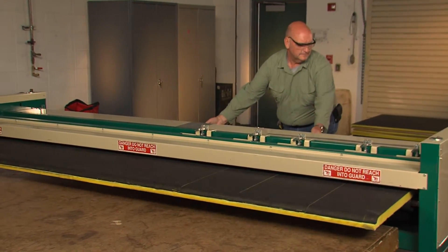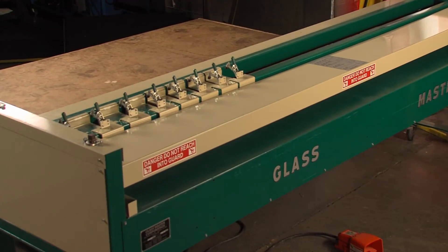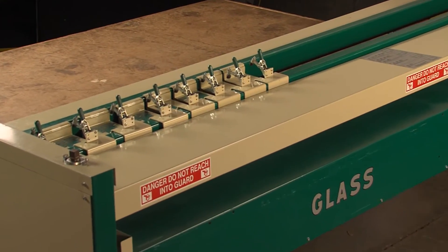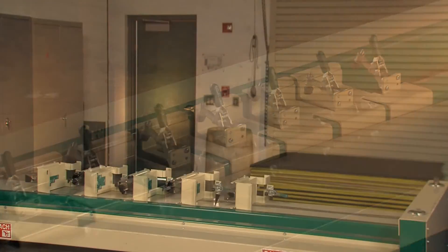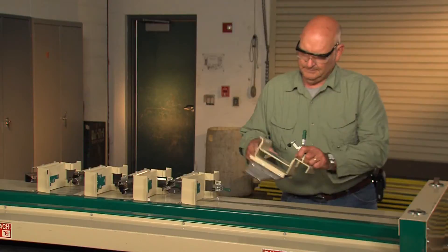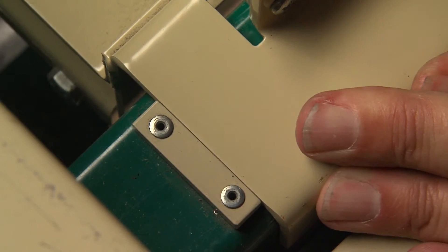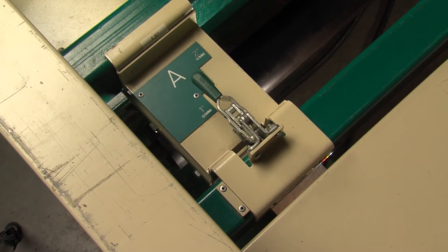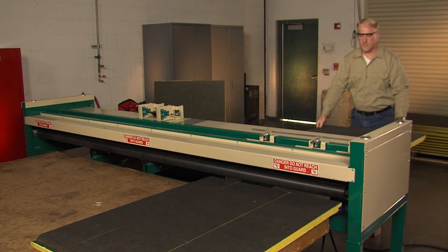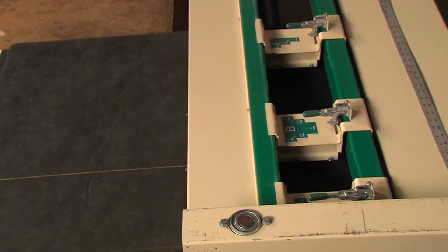The grooving machine functions by pulling the board through the friction rollers. The cutting tools are mounted on the toolbar and cut the board as it is being pulled through the machine. The simple drop-in tooling feature allows for easy setup. The tool tabs on the tool holder take care of all the add-on allowances necessary to make fiberglass ducts correctly. With a full complement of tools, you can produce ducts in all rectangular configurations accurately and quickly.